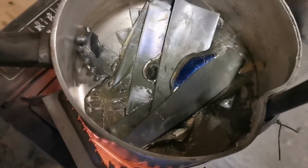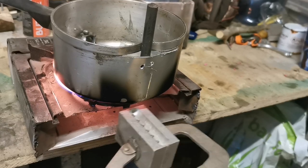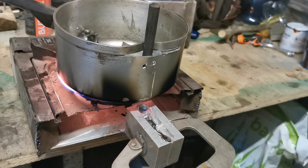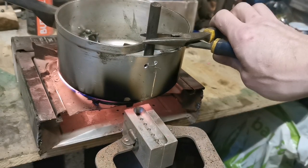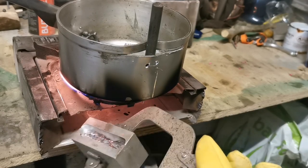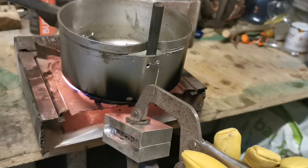As you can see, we're starting to get some runny lead, so I'm just going to prepare everything else we need to cast a few balls. I think we're just about ready to try a pour on the new pot. You never expect the first one to be too good, because by the time I get set up the mould has cooled slightly and we may not get a proper form. But the first casting definitely helps get the heat into the mould, so we'll just let this one stay a few seconds longer than normal, just to make sure the mould is getting up to the temperature we need.